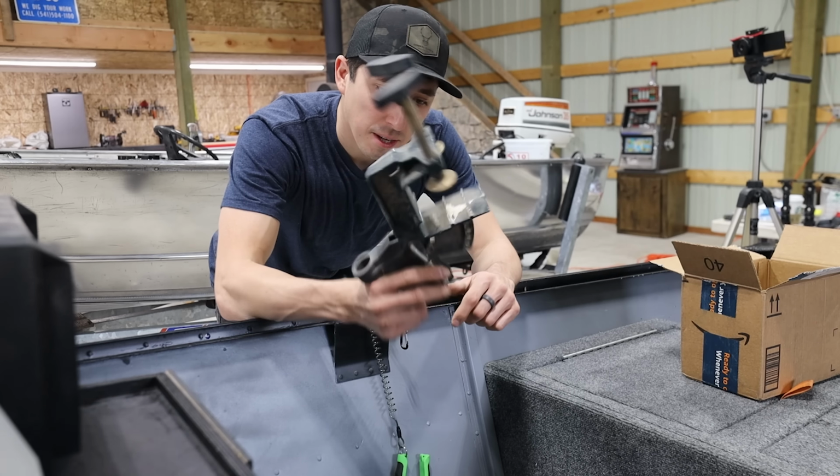So this is left over from my van build, but I had to get a guy to help me. They're not the best crimpers, but they work, I'll tell you what, in a pinch. I always look through. You can see the coppers right at the end of the connector, kind of presses up against it. Make sure it's all the way in there before you put it down so you get a good connection.